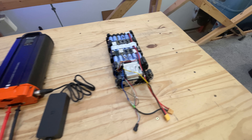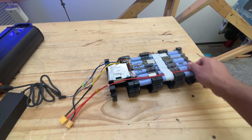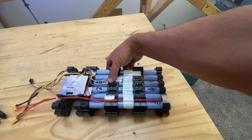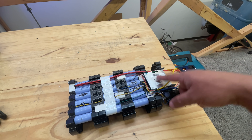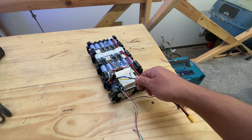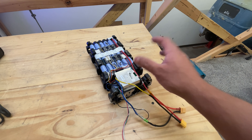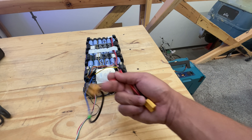While that battery is charging, I've taken another one apart — take the screws off and it slides right off. It turns out it's a 10S5P configuration, so 50 cells total. These are good quality cells: Samsung INR 18650 — I can't read the full suffix because the holders are in the way, but they're Samsung cells. There's a BMS with two ports, a charge port and a discharge port, and also a three-wire data connector that you don't seem to need to operate the battery, as you'll see later in the video.